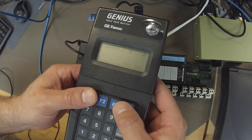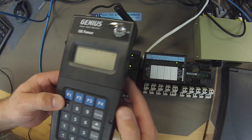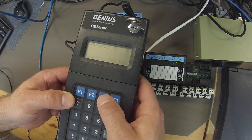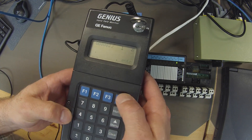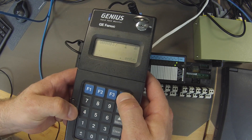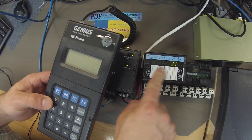What we want to do, once you're at this point, is hit force — F3, F3, 1, enter. Now I've turned on one output. I'll turn on a couple so you guys can see. I'm going to toggle over using F2 to the next output, hit force — F3, F3, 1, enter. F2 for channel output number 3, force — F3, F3, 1, enter. Now I've been able to put on all these four outputs.